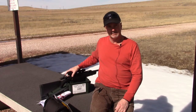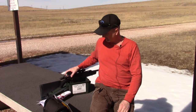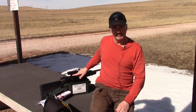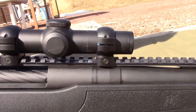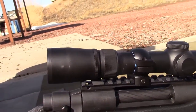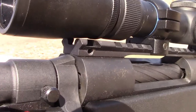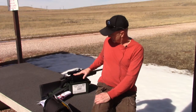Basically what I did: I got home and I was really admiring how effective this three-power Weaver scope was on the Scout rifle, but I really wanted it lower. So I pulled the peep sight off the rear, and since I pulled that off I pulled the front sight off as well, and then I had some rings that mount really low. The eyepiece on this just barely lets me shift it forward far enough to get the proper eye relief and yet clear the pic rail. It's free-floated from the pic rail and so it's really low — almost as low as you can get on a pic rail with the scope, and almost as low as iron sights.